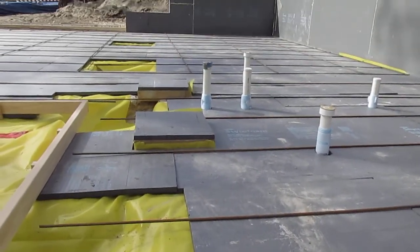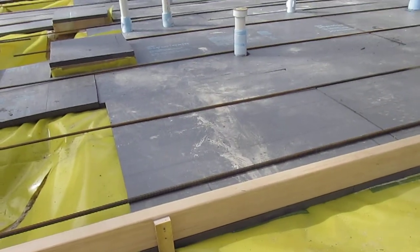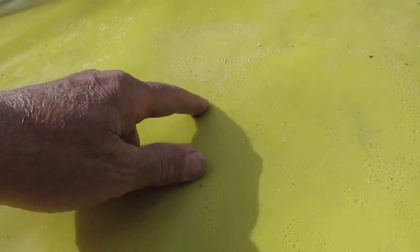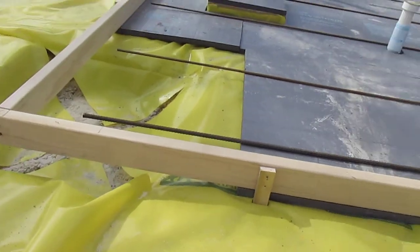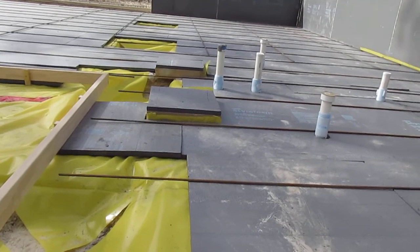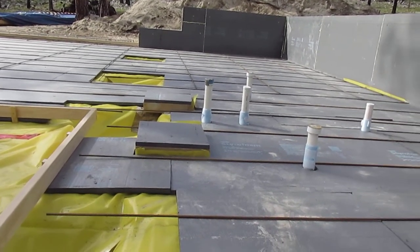I choose below the foam, because check it out — look at this thing. See those little water droplets underneath there? That's water vapor condensing on the bottom of the plastic. You don't want that water vapor to migrate through the building, and you also don't want it on top of or getting into the foam board, because the foam board when it's wet loses its R-value.